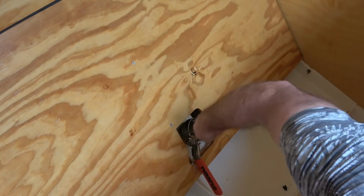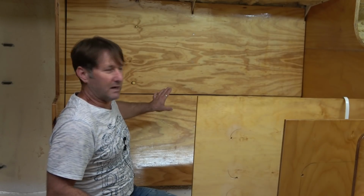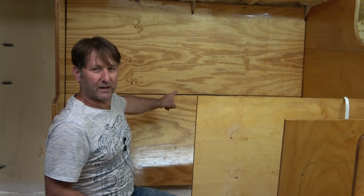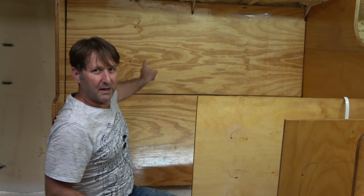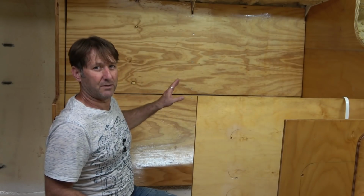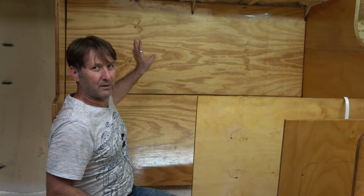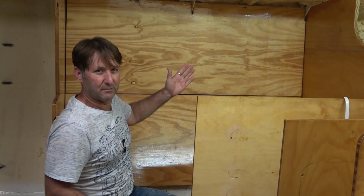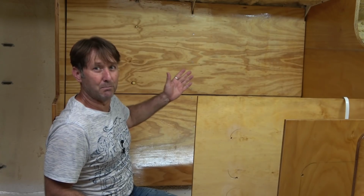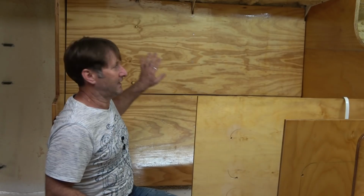It's a day I really would have missed. All in all, that is looking pretty good. There's just one side effect, I guess you could call it, from having switched over to the foam. Because it's firmer, I think what's happened is the ends of this top panel are out probably about 10 millimeters more as compared to when the earth wool insulation was there.